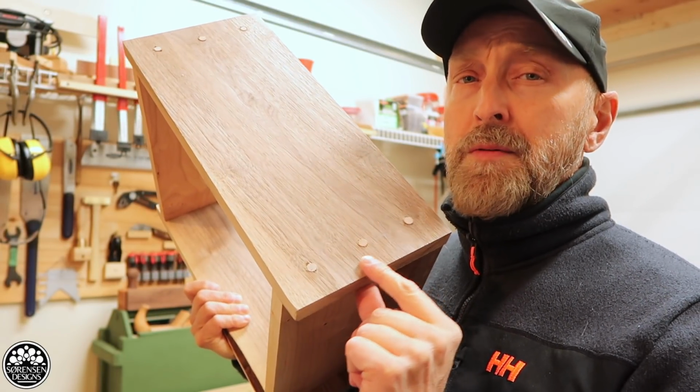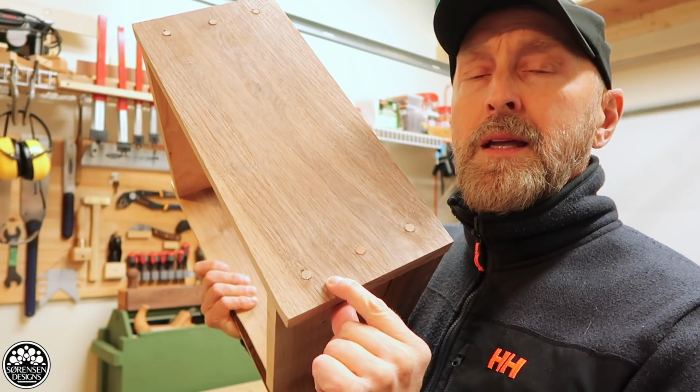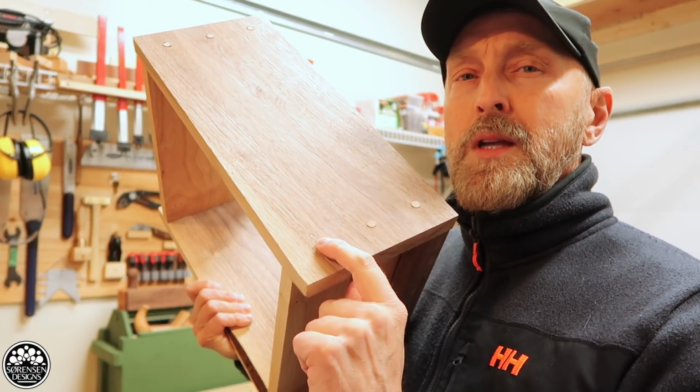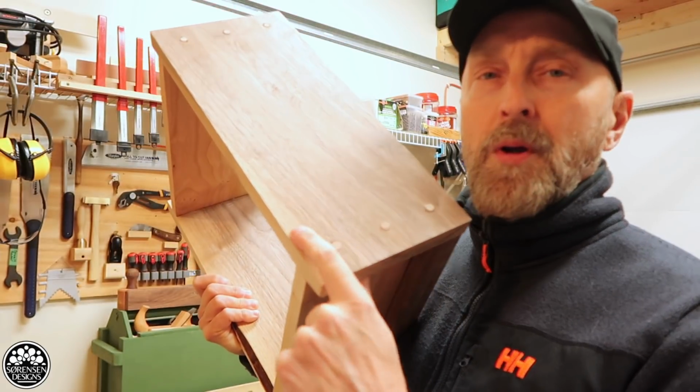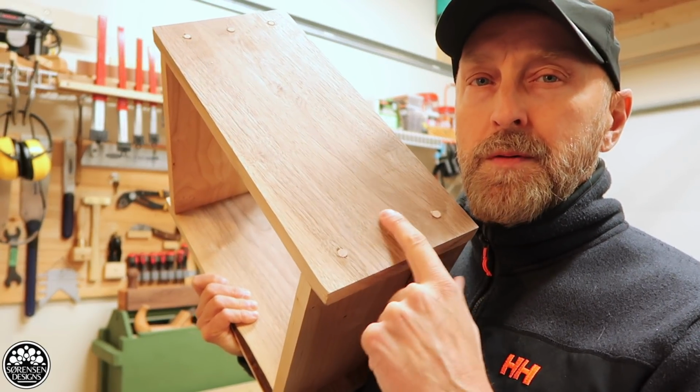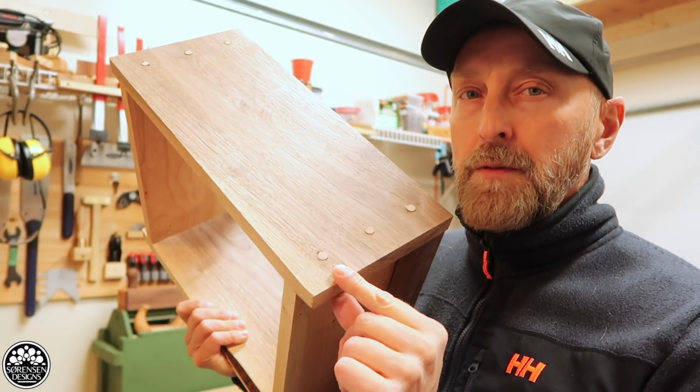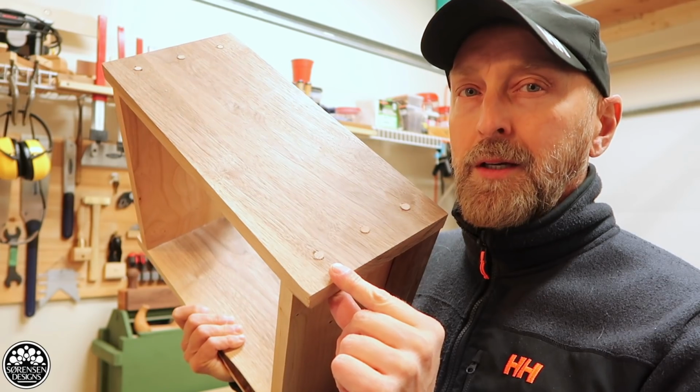Of course, there's different ways you can do that. You can use a small block plane, or you can use a chisel, or you can try and saw it and put all sorts of horrible marks all over the surface of your wood. The best way to do it though is to make a quick little jig for your trim router, and I'll show you how to do it.